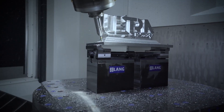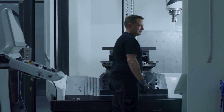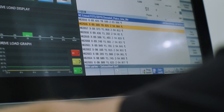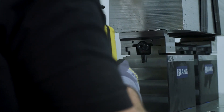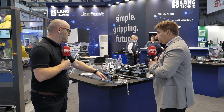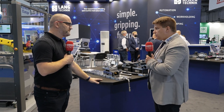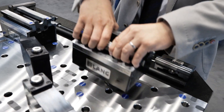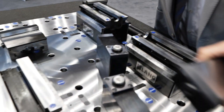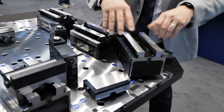That's a very good idea. So where do you typically see these vices fitting — would it be on a larger machine tool? A larger machine — the mold making industry is very popular. Whereas typically we're looking at centric, self-centering vices predominantly for five-axis, not only five-axis. Not only, but mainly — the aim is to provide it for five-axis machines. But on this technology I'm also seeing a three-axis VMC, maybe even a large horizontal as well — yes, correct, but also large five-axis machines.